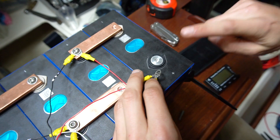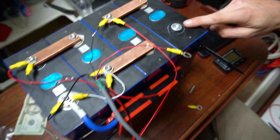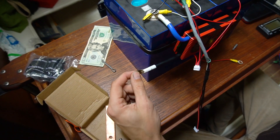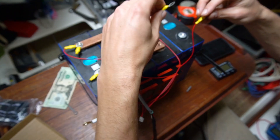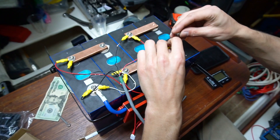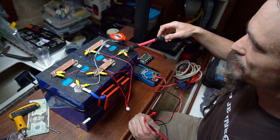We're going to hook up the charger. The solar positive is going to go here — or any load goes here as well — and this will be our negative, so negative and positive for the entire battery. For now I'll just hook this in loosely. We've got it all connected with this temporary positive wire coming off our positive terminal.